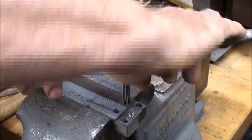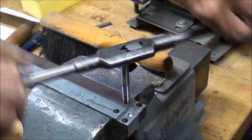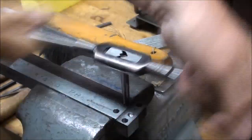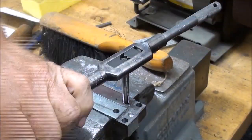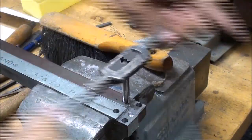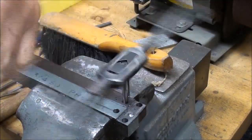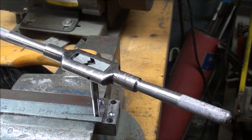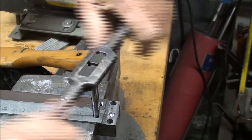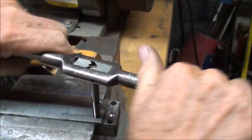No oil. Taps freely enough. Now for the cold rolled steel — I've already started it just to save a little time. Again, no oil. Oh, does that feel sticky in comparison — like it wants oil! The other one didn't say 'oil me please,' but boy does this one ever. Can you hear the clicking?